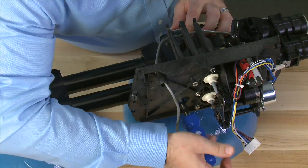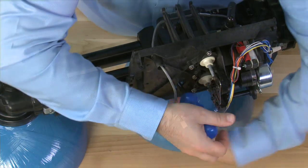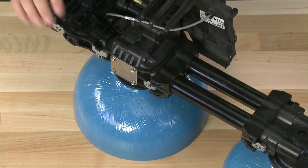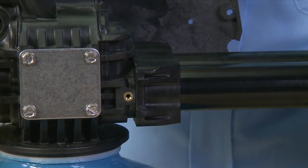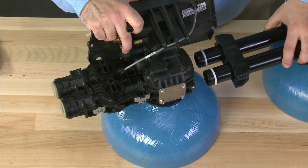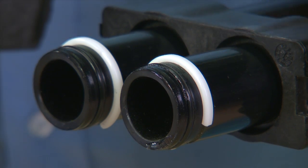Both sides have the same screw and clip adapters, so we remove the screw fully. Once the screw and clip are removed, we can move to the back side and remove the identical screw and clip from this side. Once those are loose, we can pull back the collar and pull the second tank adapter loose where it seals to the body on an O-ring.